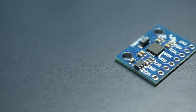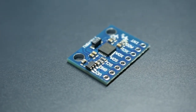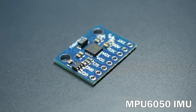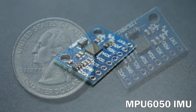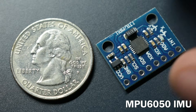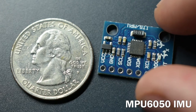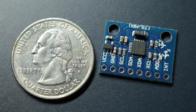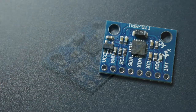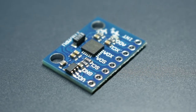Arguably, the most important component I'm going to be using is the MPU-6050 Inertial Measurement Unit. This module uses both an accelerometer and gyroscope to get data, but we're only going to be using the gyro to read the angles of the robot in a single axis. Check out the link in the cards or in the description to get a full explanation on how the MEMS gyro works.